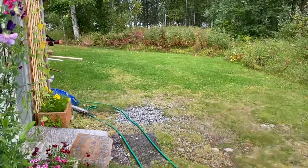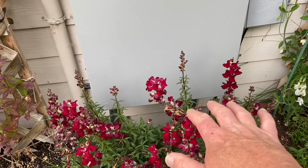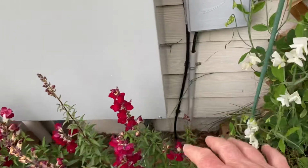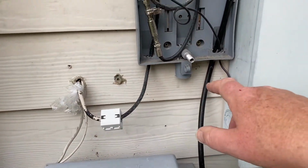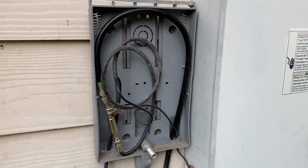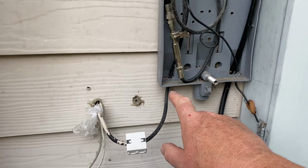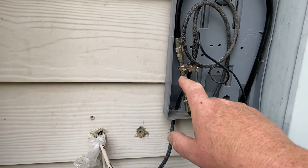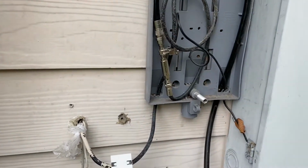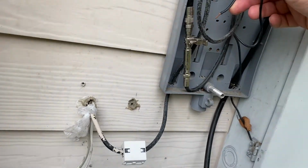There's some interaction between the two, so there's some coupling between the mains safety earth system, or the AC 110 to 120 volt safety systems here, and it gets back from their modem, which is located in my office space. And what's happening is the noise is coming back up here from the modem or modems, and also some AC switch mode power supplies connected to it. Should be just going straight out, but they've electrically safety bonded, which is fine, rather tattily.